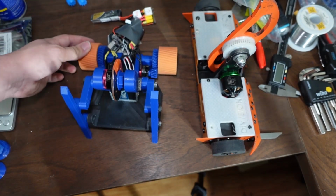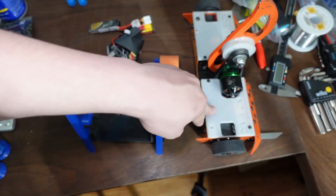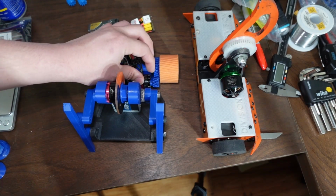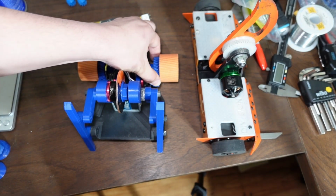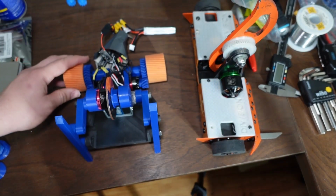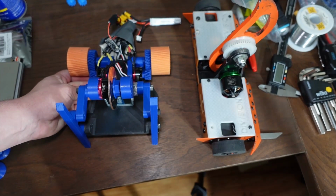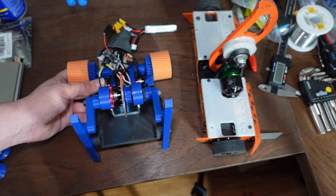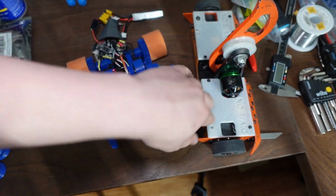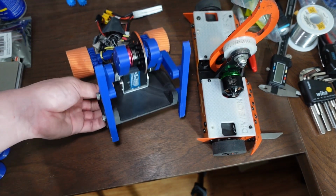And I had to make a trade-off with the drive because I really want pushing power, but you simply can't get a ton of pushing power when you don't have a high reduction, like the 15:1 that I have in Division. So instead of using a dinky little 1806 motor and a 15:1 reduction, I'm using a gigantic motor and a much smaller reduction of 2.6:1 to keep the cost down, and also to allow me to use really big beefy steel bolts as the shafts. There's lots of different things that drove the decision to go with this for the drive system, but at the end of the day, by using a motor that can supply a lot more torque, even at a lower reduction, I get pretty similar, if not better, pushing power, and by using big wheels, I have enough grip that I get way more pushing power out of this guy than I'll ever get out of Division, even though its drivetrain is geared down in a way that's more suitable generally for pushing. So those are just different trade-offs.